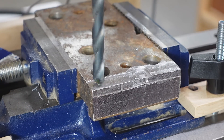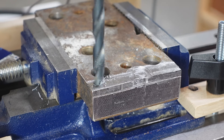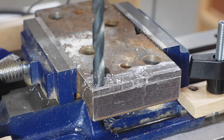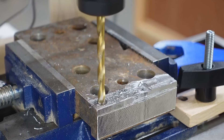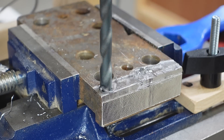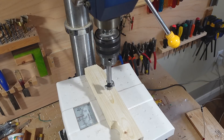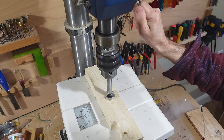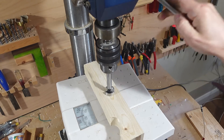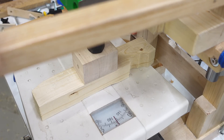Trying to drill some steel with a metal bit — this is about a 9mm, almost 3/8ths of an inch bit. It is drilling in the metal but much slower than I'd like. The problem here is not lack of power, but I just don't have enough downforce compared to a real drill press. I decided to drill a smaller hole first, then follow it up with the bigger hole — oh yeah, that's some better sized chips. In terms of pushing down, I can easily press 110 kg or 240 lbs with my drill press, whereas with my homemade machine, pressing even half of that much is a bit iffy. So on that front, the drill press definitely wins.